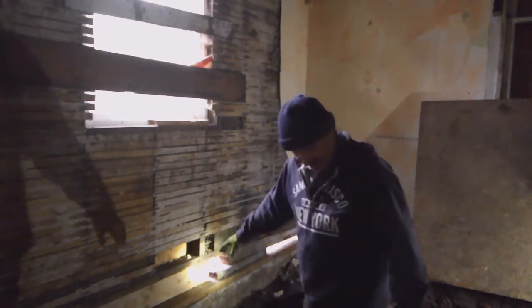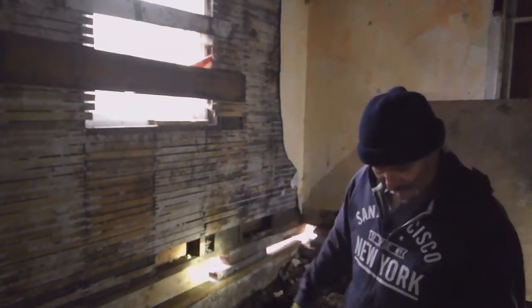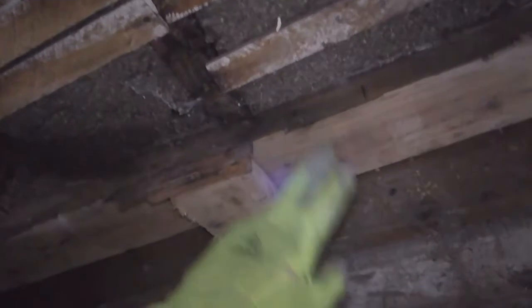Anyway, I wanted to tell you the other day, I put this rim joist in over here. Let me give you a closer look at what we're doing. I had a wedge stuck in here to hold that bottom plate up from the wall so that it's like 6 inches wide. And of course, 2x6 is only 5.5, right? This was still almost 6 inches down here. Oh, you almost can't see that. All I had to do is clear this 2x4 right here, and I stuck it in there.